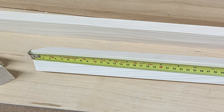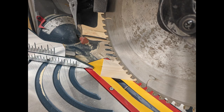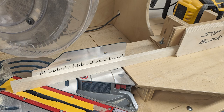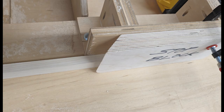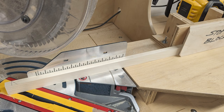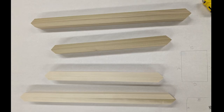Now I'll make another measurement. From the outermost point of that angled cut, I measure to my desired length. I don't need to do this for all my sides, just once per length. My saw blade is already set to a 45 degree angle, so I bring my wood over and line the measurement up with the saw blade itself. I want the saw blade to come down just on the outside of my measurement. Holding my wood in this exact spot, I'm now able to set up my stop block. The stop block is already cut at a 45 degree angle, so it's going to cradle our mitered stick perfectly and I'll secure it to the backstop and make my cut. Now we can take any other stick that needs to be the same length, throw it in that stop block, and it will be cut down to the exact same size. Once they're done, I can turn them around and match them up to make sure that everything is even.